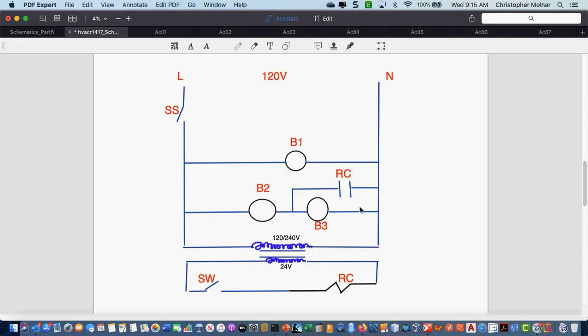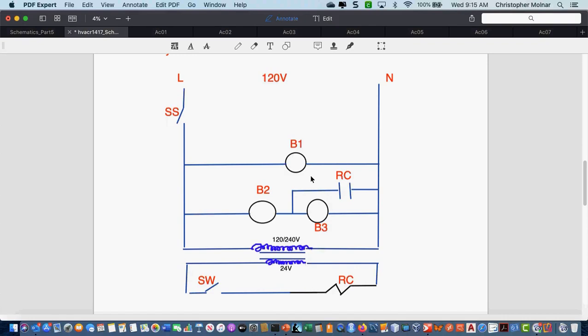Now this circuit, will it do the same thing as the previous circuit did? Yes. What is our difference? If we're dealing with a control situation in air conditioning, why is this circuit a better circuit for us to use? Because you don't have to hunt down the bypass switch to turn it on and off. You can use the relay coil. What about safety? Oh, yeah, that too. Your answer is not wrong, okay? But again, we're building towards our air conditioning circuits. So part of what we want to do is remember that the control voltage is what's going into people's houses. That's the whole purpose there.